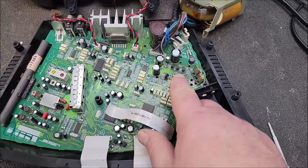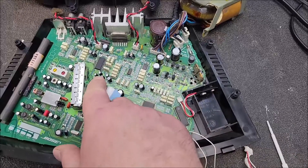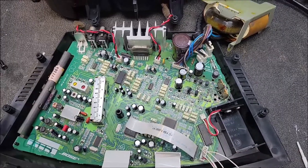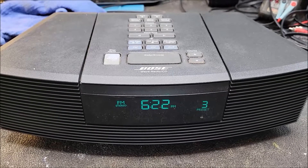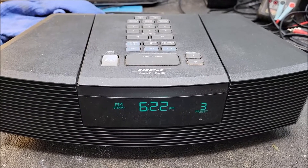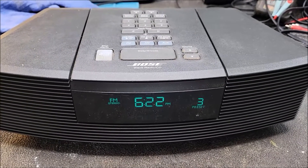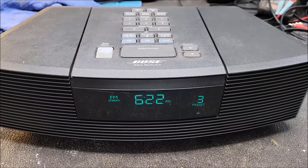Open transistor, heated-up resistor, 10-volt regulator running low — the problem turned out to be this little IC right here. So just FYI for the future. This little Bose Wave Radio is all back together and playing. In this case: one transistor, one IC. And I did go ahead and replace the caps, however I probably didn't need to — but I think I did it more preventatively than anything else.